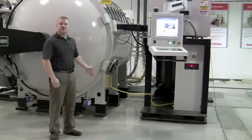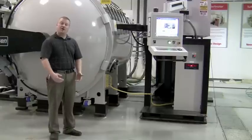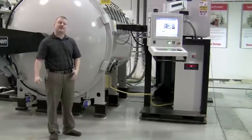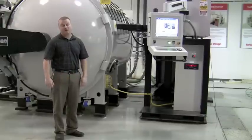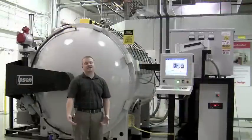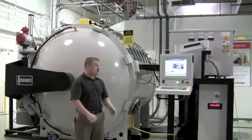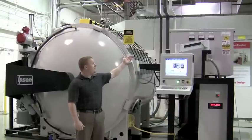These are the work TCs. These allow the furnace to control the time at temperature off of the parts instead of the furnace itself, which guarantees that the parts are at temperature for the time that you want. During the cycle, when the heat is on, you can monitor the heat by temperature on the control screen, or by the current that is shown on the VRT.